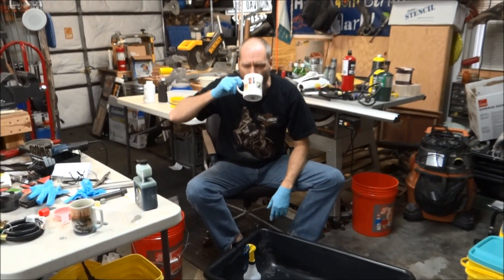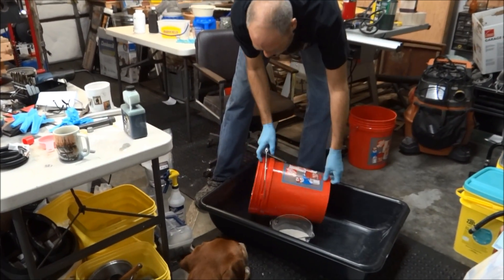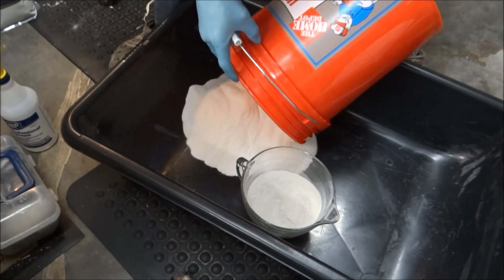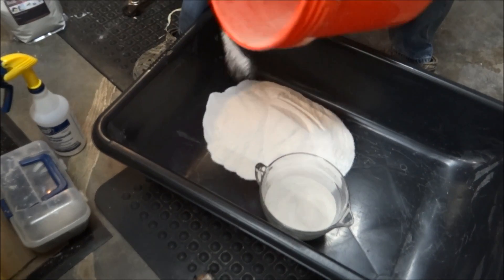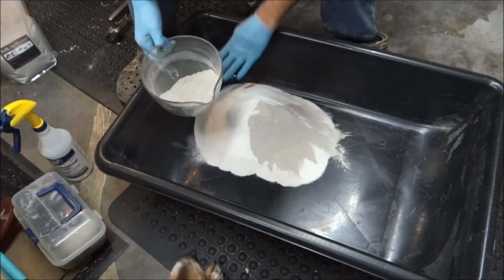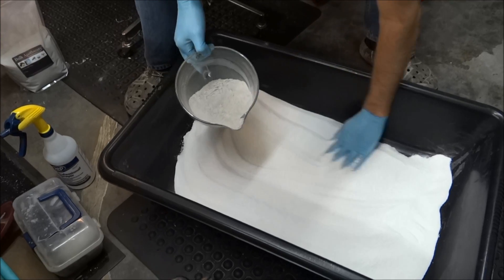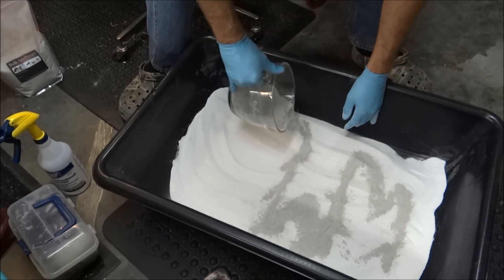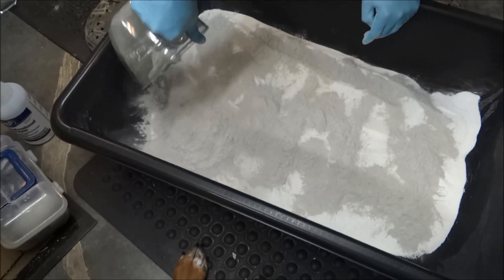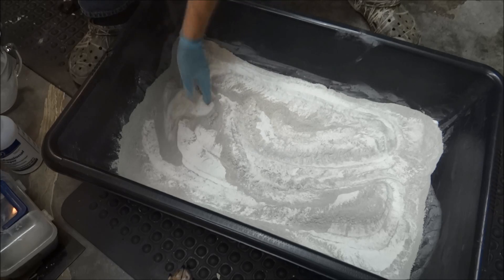Did I say Happy New Year? Happy New Year! It's going to be a new year. Hot coffee in the new year. Okay, so step one: twelve and a half pounds of the sand — still up the sand, this is very fine, don't go pouring it too fast because it'll all blow away. Twelve and a half pounds of that. And then one and a half pounds of the bentonite. Then spread this out — it's very cold and very fine. This is going to help hold the moisture right into your sand.